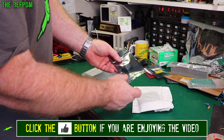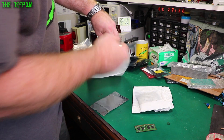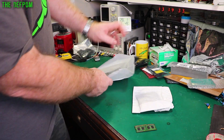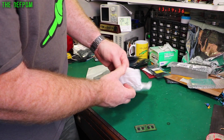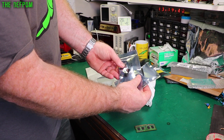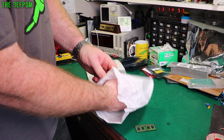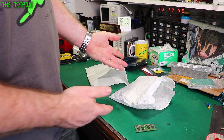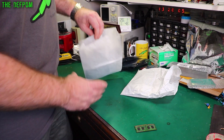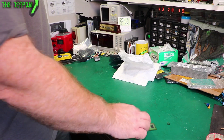So what do we have here? AD7528JNZ — that's a digital-to-analog converter. I've got two of those. These are fairly expensive devices. This particular one is 2-channel 8-bit. And what's this one? AD7524JNZ — these are also 2-channel 8-bit digital-to-analog converters. These are for the Marconi, which uses them as part of the audio circuitry, but probably also some other stuff. They may also be used in other Marconi bits of gear. They're expensive, but now I've got some. Pays to get them while you can, especially if you're going to be repairing old gear like me.